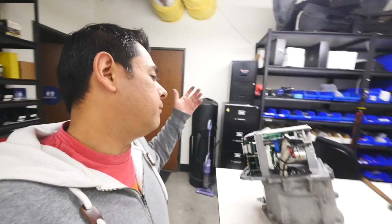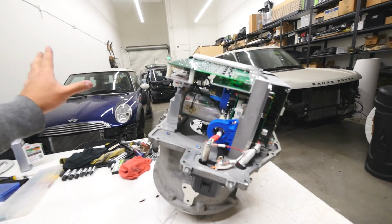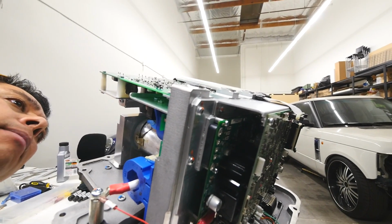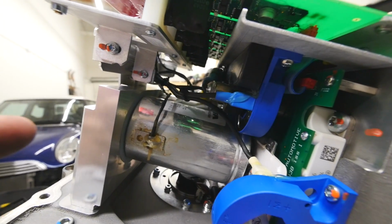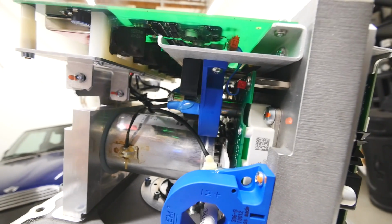It's super late. I wanted to do something for you guys to see. This is the Zytek 55 kilowatt controller and motor that somehow is throttled back down to 30 kilowatts. We don't know why that is. We don't know if it's in the software, but this is what it looks like. Big giant capacitors. Oh, look at that thing. What is that? Output. Oh, that's the little thing that feeds the IGBT drivers. Look, it's got plus and negative 15 volts DC, 1 amp, and it has a big one like that. That's just a DC to DC.